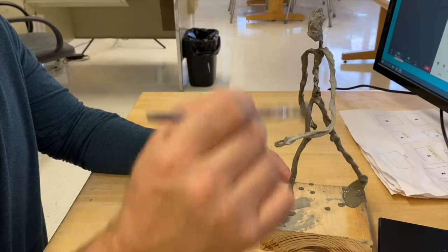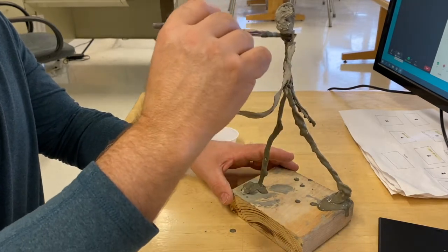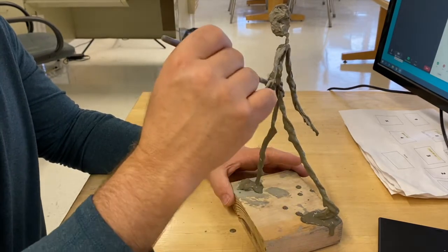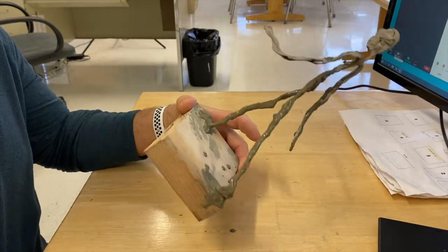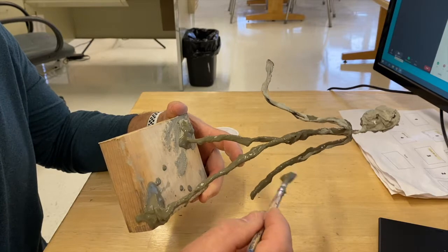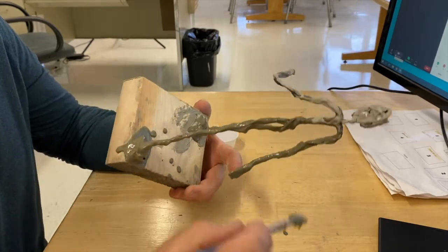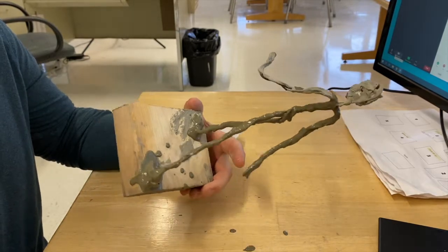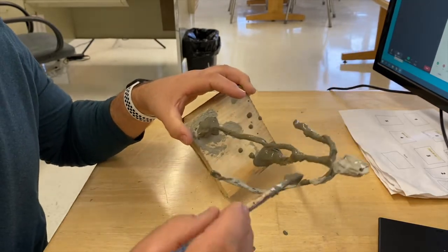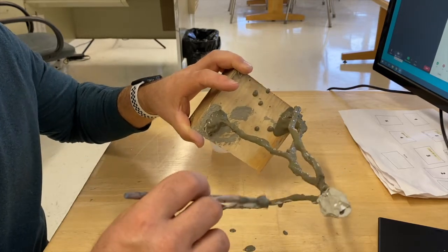Some students said it looked pretty easy when I was doing it, but they were having a harder time with it. My response was that I've done it several times, so you get a little bit better if you do it a couple of times. It's really important that you don't have any holes or gaps, so if you see some of those, fill them with the thinset cement. You may have to do that a couple of times because it's thin, but over the four coats you should be able to do it with no problem.